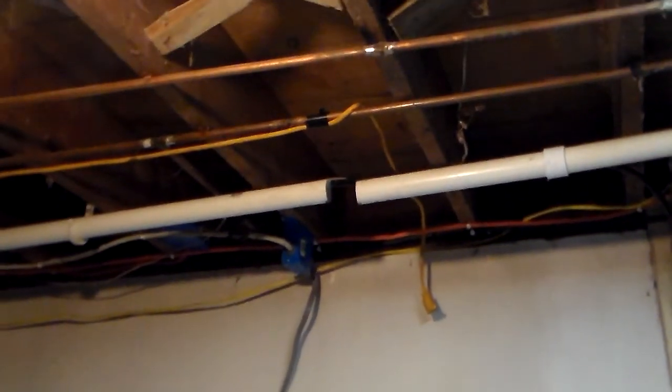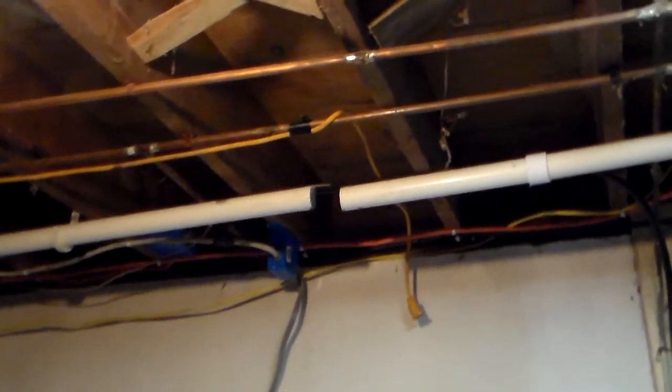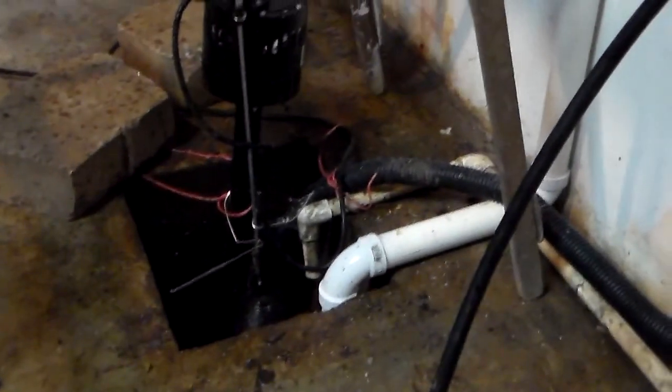Okay, I've cut my hole in my line and I've already got the drain pipe constructed, glued together, and put in place. I have to find a better way to anchor it to the wall because my concrete bit is not sinking into the concrete for me to put a wall anchor on it.